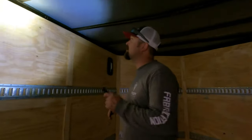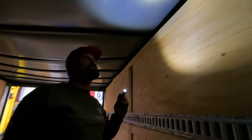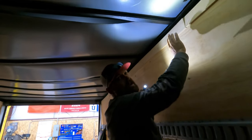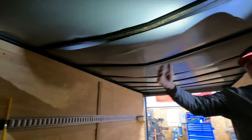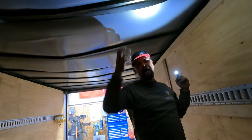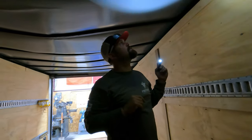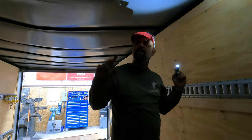Now, the next thing we've got to do is to start cutting them out. It is going to be a little tricky. I've checked it out and it looks like there is some weld in there. It could be a little bit of a surgical process. So I think what I'm going to do is take a cutoff wheel and cut it back here, and I'll cut on that side and drop the middle section out, and then I'll grab the end piece and see if I can move it back and forth until the little weld breaks. Hopefully that'll get it off so that I can clean them all up and get the new ones up.